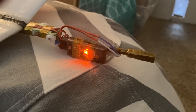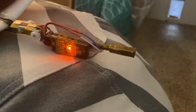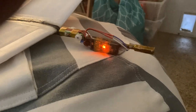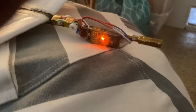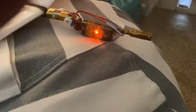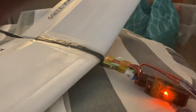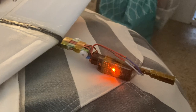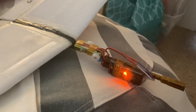That is a roll of lead tape made to weight golf clubs. I don't know if any of you know anything about golf. A lot of times people will stick lead tape on their irons to change the swing weight. That works excellent. It's 1 gram per inch. So basically I cut off two 5-inch pieces of it, and it's already got adhesive on it. So I just wrapped it around the front of the rod and then I put some Kapton tape over everything. You can see I've really grown fond of Kapton tape. The yellowish stuff there works awesome. No stretch, no residue when you pull it back off. It works excellent to tape things down.